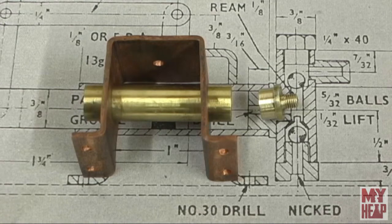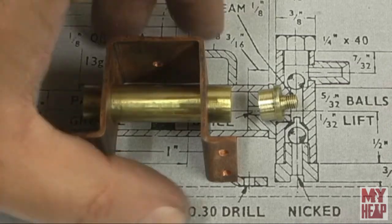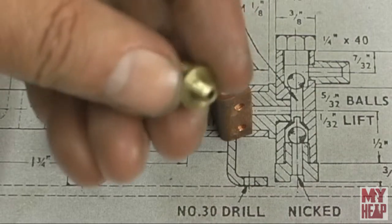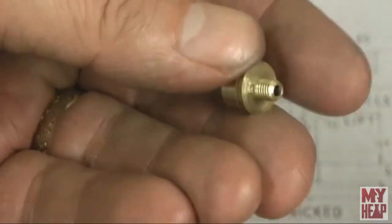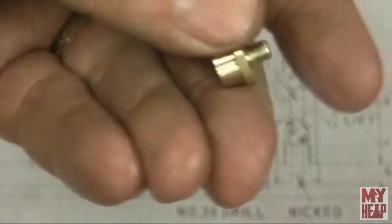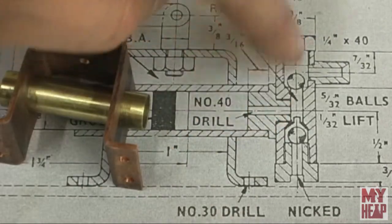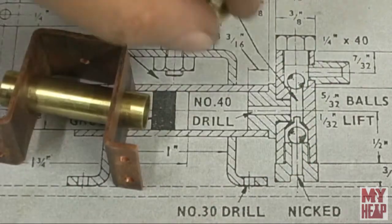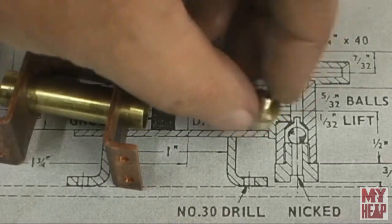So just for you other newbies out there, pay close attention to your tooling and its alignment and sizes. If you're going to cut a very small thread like this, it pays to have it just a couple - two or three thousandths under. I was either at 185 or 184 thousandths. Anyway, that's going to work, because when we drill the hole in the side of the main pump body, that'll thread in there and then everything will get soldered up afterwards.